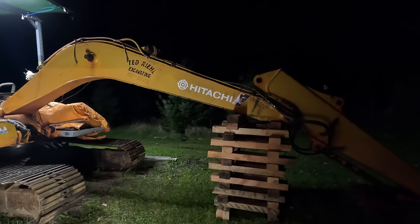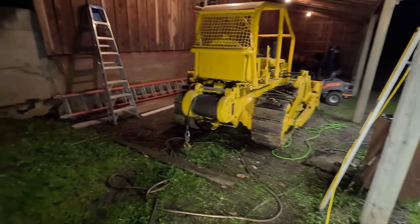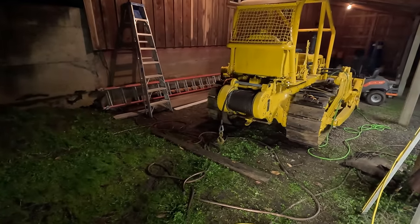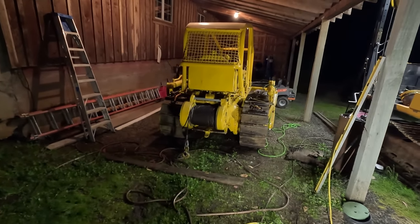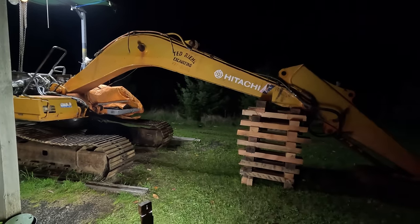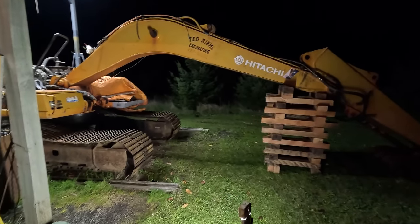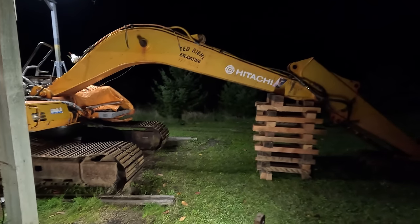The other suggestion, and quite a few people suggested this, was using compressed air to separate the piston rod from the barrels. To be fair, I've done that quite a bit on smaller cylinders. But these are 4-inch, 4.5-inch diameter cylinders. If you calculate the surface area and you're using like 150 PSI, that ends up being like 2,500 pounds, over a metric ton of force. That's a lot of energy. And once the rod exits the barrel, you're kind of just on your own as far as what happens. This is just my opinion, but I think they're too big to do stuff like that.